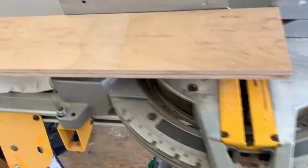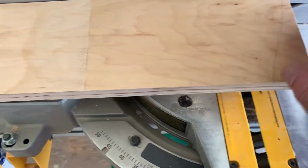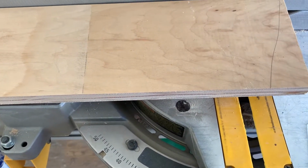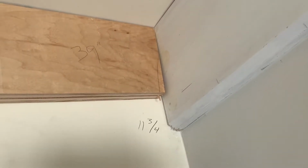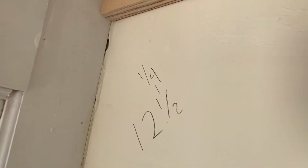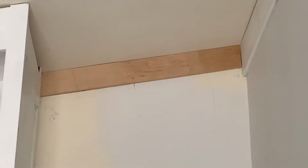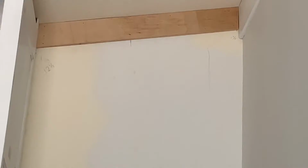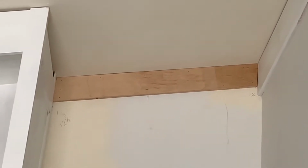If I remember right, those are at a 12-degree angle. So I always forget. I think though that gets you going down. All right, this angle is roughly 11 3/4. This is a cut to, I forget what, 12 1/4 degrees, not anything else. So, and then this is good, somewhere between 12 1/4, 12. All right, so you can see that on this right side, over here, that when I go to actually do the beam, I need to tighten up the angle a little bit.